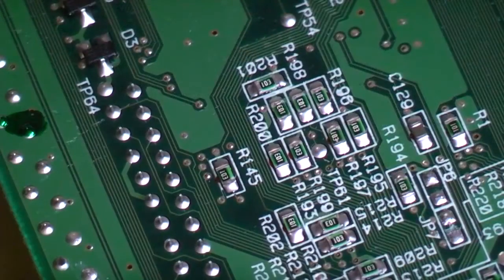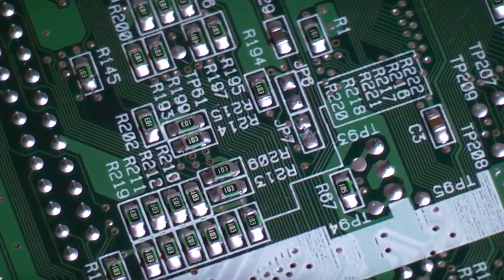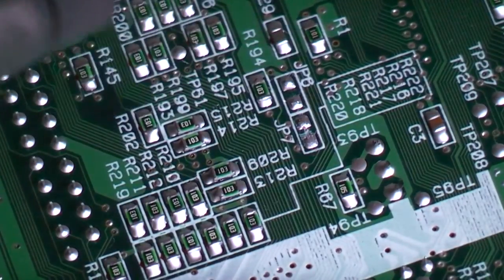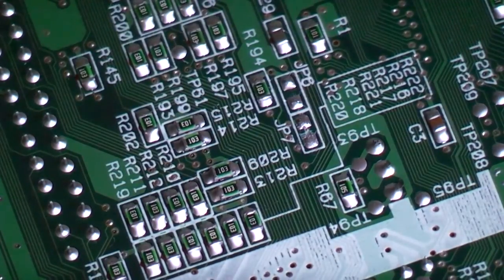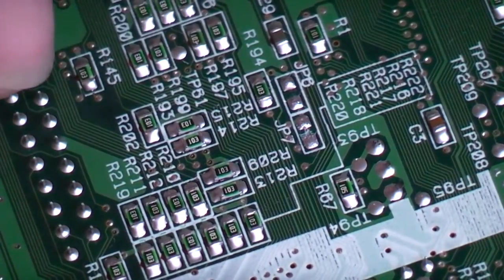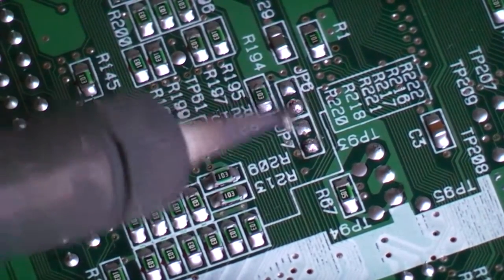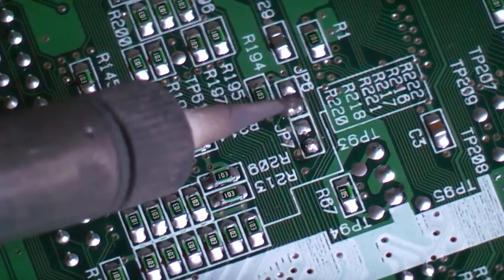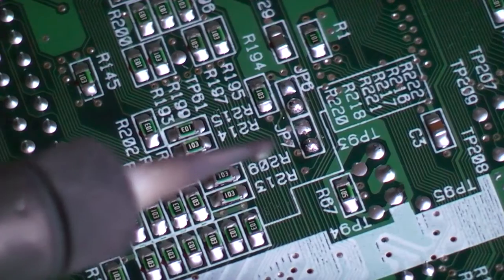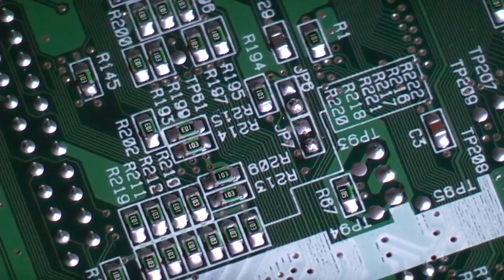I've been through and got my little track severed and checked it with the multimeter - it's definitely not connected. The cartridge connector is at the top right, so this is the bottom of the board near the joystick sockets for reference. That's jumper 6 and 7, and because they're internally linked it doesn't matter which one you solder to. From our mod chip I'm going to solder on our yellow wire, which gives either 5 volts or ground to indicate the region.